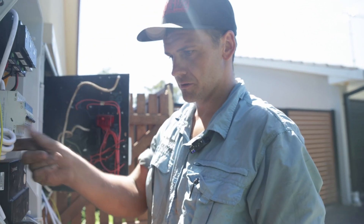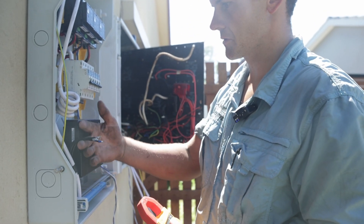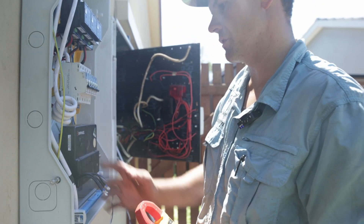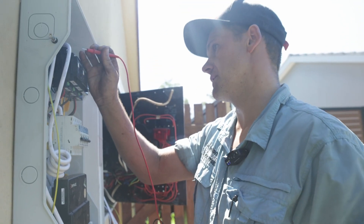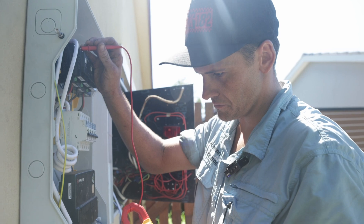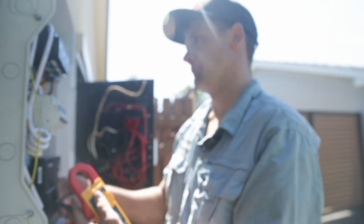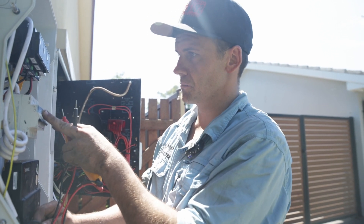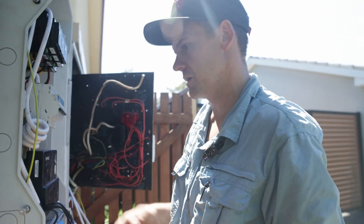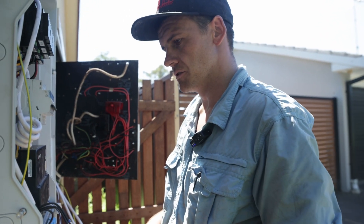So this is the feed coming in and I know it's in number one so I'll leave that as is. All I'm doing is taking out the guys who have done the pre-wiring. I'm just going to test each neutral. So that's relay A and I'm just going to put relay A — it's the third breaker in — I'm just going to put it in number three neutral.